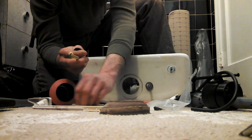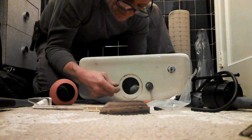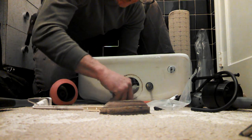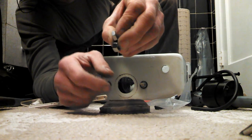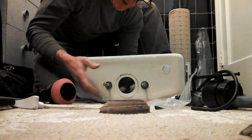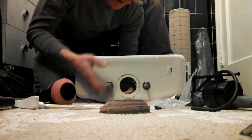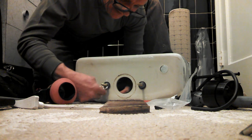because it's a big head on the bolt, we don't really need the washer. The washer we're going to save for when we put the bowl actually on the tank. So, a rubber washer and a metal washer on this side. Then the bolt. You see there's a thicker bolt and a thinner bolt. So we're going to use the thinner bolt here because there's clearance issues between the bowl and the tank. That's a neat little trick by this company. Again, not mentioning any names because we don't have any sponsorship.